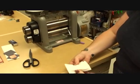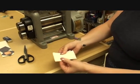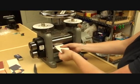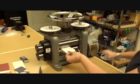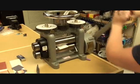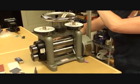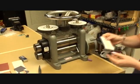I do also want to make certain that my paper towel wraps around my entire piece and hangs off the edges and that my metal's not sticking out. Otherwise, I won't get the pressure that I need from the mill. At this point, I'm ready to go ahead and start to roll. I'm going to push this in until my piece becomes tight, and then I'm going to roll this through the mill. You should be able to do this without too much effort. If you have too much effort, then it also means that you are stretching out your material and maybe thinning it out in an undesirable way.